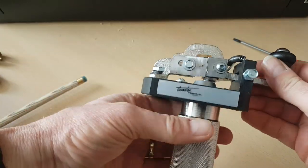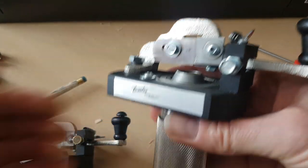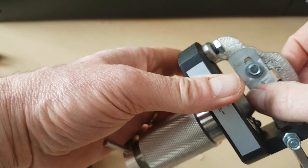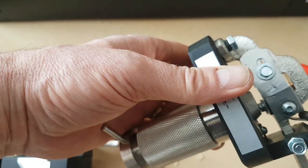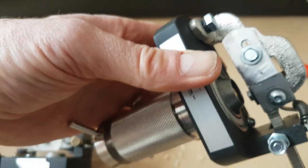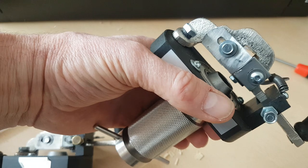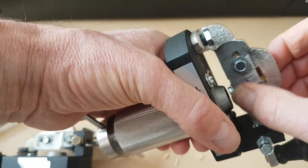Now, a couple of faults I've been told about. This is a brand new one. I'll show you the distance between the mouth and the cutting edge — it's brand new with a nice sharp blade. If I run my finger just across there — be careful, you could cut yourself — I can just about feel the bottom cutting edge sticking up above. It's minute, but it's got to come a little bit above, because that's the piece you want to cut first. If it doesn't, you can end up ripping the tenon. Always make sure you can just feel it sticking above. They are a pain to adjust, so if you ever have to swap the blades, photograph a couple of different angles because you can spend hours on it — there are no instructions anywhere.